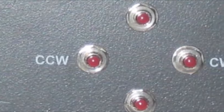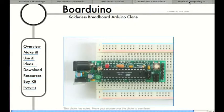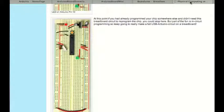Satellite enthusiasts might have heard of Arduino and not know what it is. Let's start with the hardware. This comes in a variety of sizes and functions, but what they all have in common is an ATmega processor with a small bootloader that makes it possible to program the processor through a serial or USB connection. Some of us like to just pop a bootloaded ATmega on a breadboard like this.